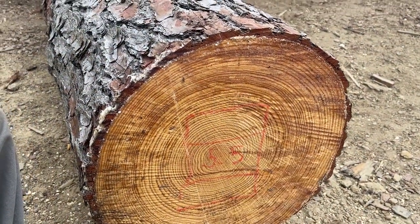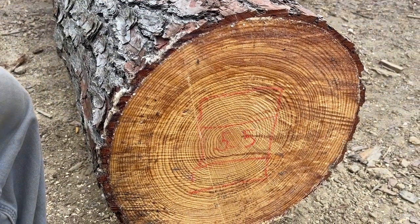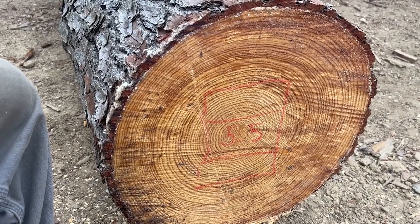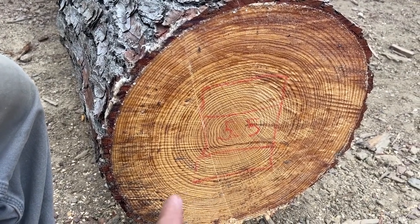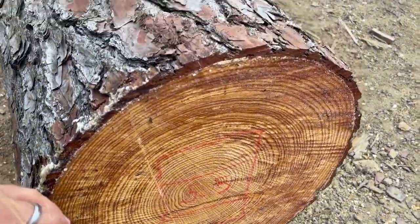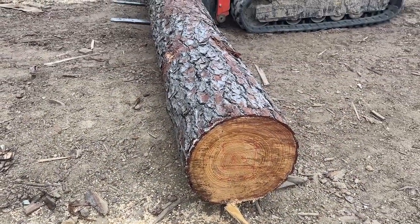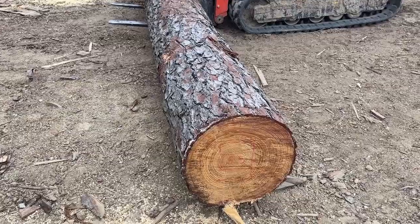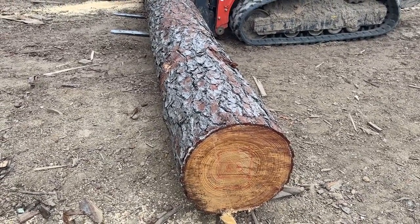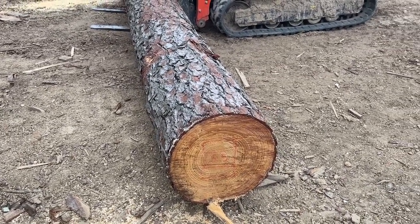And then off all of our side cuts, we've actually got an order for nominal sawn 1x6s by 16 feet. So we're gonna also pull flat sawn 1x6s off the side of this as we square up our cant for our beams. So this could be a really, really productive log for us. And when you get into milling a lot like this, you really have to get to where you can start to read the logs and start to plan. If you get multiple orders, try to plan how you can maximize the value out of your logs and obviously minimize waste. So let's get this set up on the mill. We're gonna get a new blade put on, get all of our fuel, water, get everything ready. We're gonna throw this baby up there and make a little money.